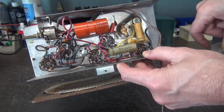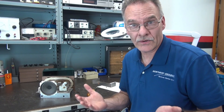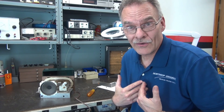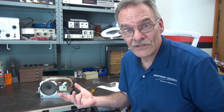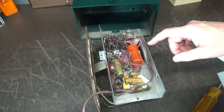The filter cap and definitely all these wax caps that are dripping have got to go. I just get in here, pull out those caps, put in fresh ones, and move on. A lot of you write in asking why I don't take a cap meter and check which ones are bad. My response: why? It's an old radio — these things are like 50 to 60 years old. They've got to be changed. I'm not going to waste my time checking them. That's not how D-Lab operates.